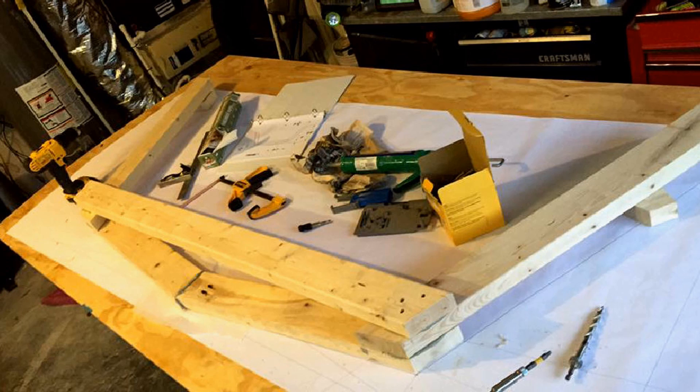Now let's talk about how to build a Hatteras. Like most of my boats, these are built around frames. You can see each element of the frame is a straight member, so you just need to cut out those elements. This one is laying out on a piece of white paper that's laid over a piece of plywood used as a worktop. The various pieces are cut out in accordance with your layout and then glued and screwed together — a very simple process using all standard size lumber.